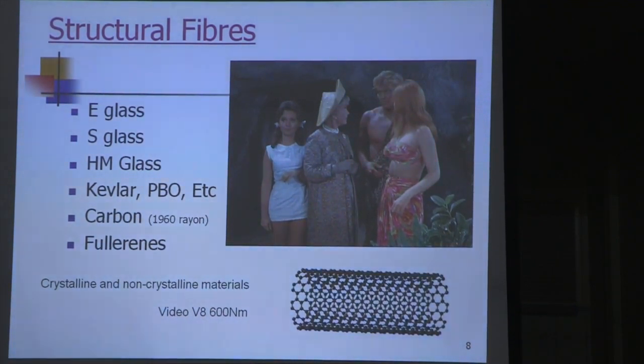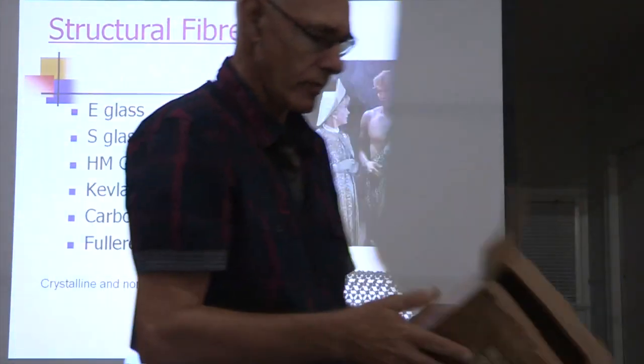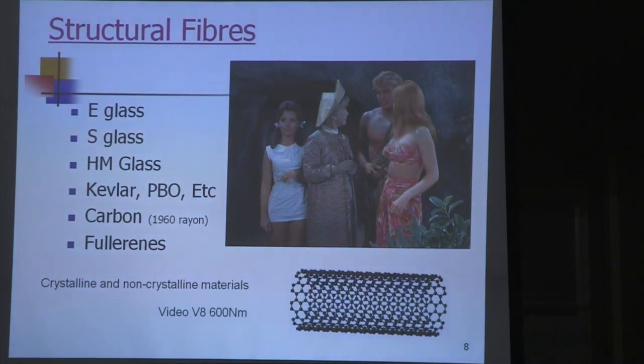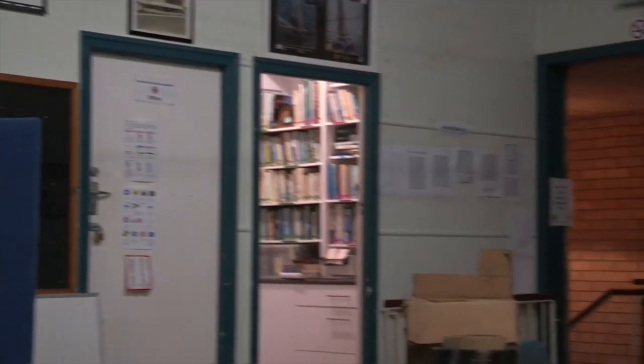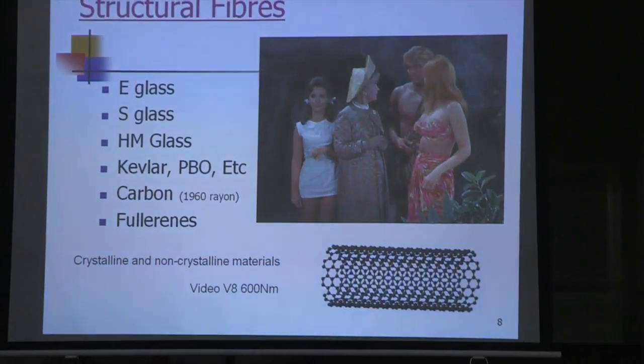And this is, how many tows is that? I forget. This is 6,000, okay. That's 6K tow. So that means there's 6,000 fibres on there, and so it came from 6,000 holes. There were 6,000 holes in the reactor, and they all fell in space if it was glass, not carbon. And then they grabbed it at some point when it set and rolled it up and it looked like that, except it's clear. That all happened in the late 50s, and they were making fiberglass for insulation.